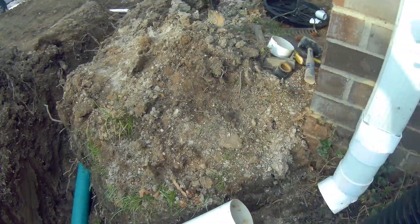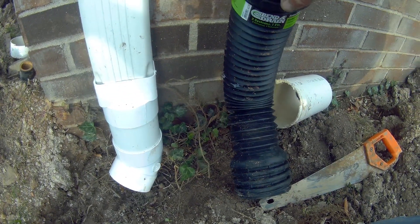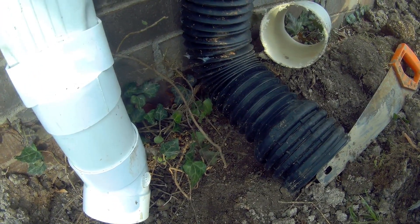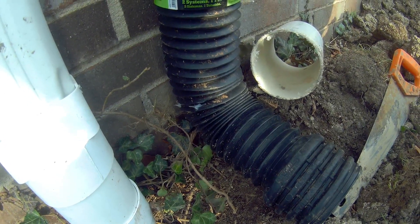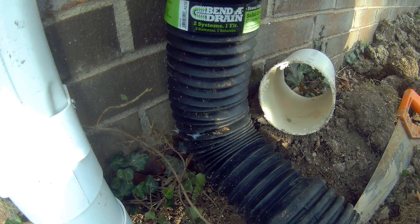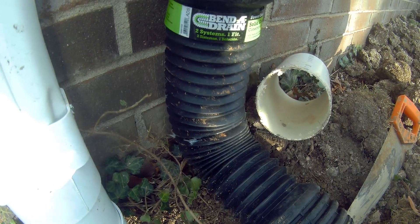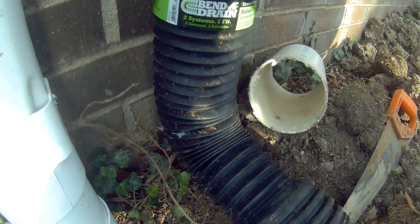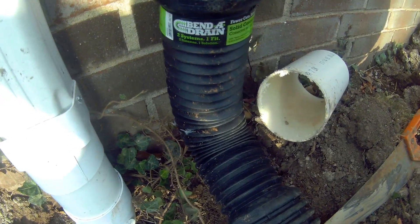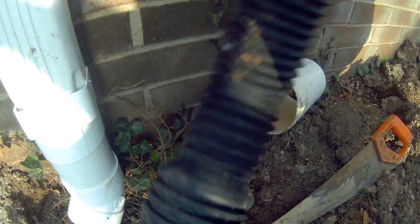What you see a lot of people do — this is not actual corrugated pipe, it's one of those extensions, but I'm using it for demonstration purposes — the ridges on this one are more pronounced. Whenever they install it, they like to go straight down and make a real hard 90-degree turn. When they do that, they're creating a pinch point, and with these ridges and that pinch point, any debris — especially asphalt from the roof shingles — always gets caught in there. It may take a couple of years, but over time this will get clogged. Due to these ridges, you just don't get good debris movement through the system.